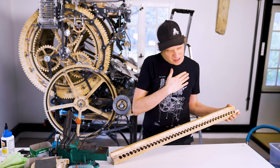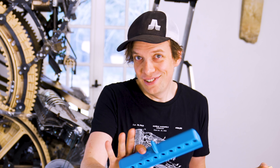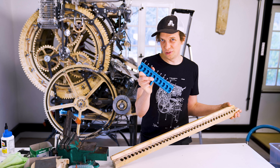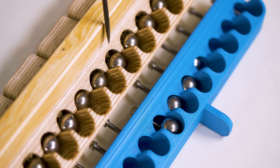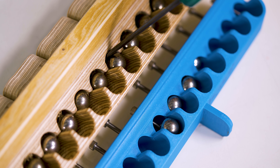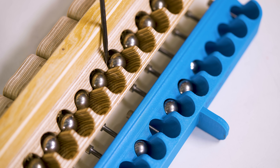I started to put it on the machine and it just didn't feel right. I'm going to make a bold claim here: different materials have different properties. I think the problems I'm having with the plywood version are due to the fact that I couldn't exactly copy this prototype. In the 3D printed prototype, there's a razor sharp edge which allows the surrounding plastic to be very tight to the marble. On the plywood version, I rounded over that edge with the Dremel, and there's much more space — I can put a screwdriver in between the wood and the marble. I've created a little pocket for the marble to rest in, and on this prototype that pocket exists but it's much, much smaller.